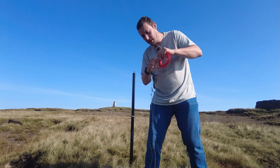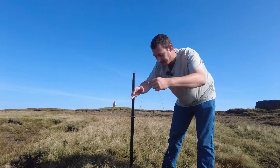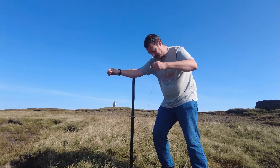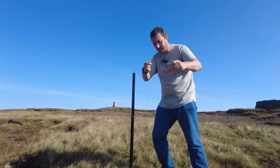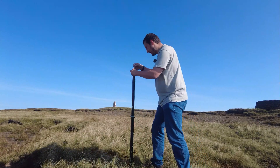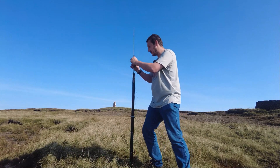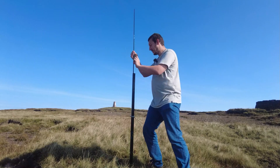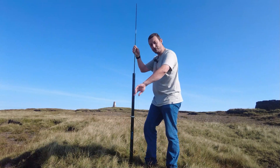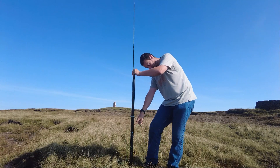What I do is take my little piece of aquarium tube, slide the wire through it until I get to that bit of black tape, then slide it over the top section of the mast. That way I know when I extend the mast, the feed point for the 49-to-1 will be right at the bottom of the mast, or just below the guy ring.